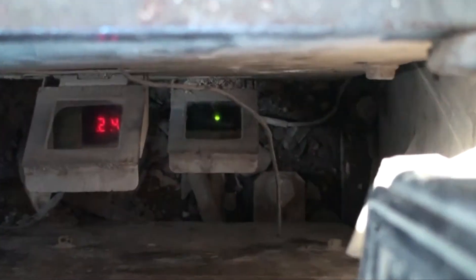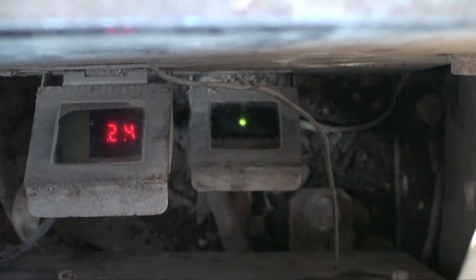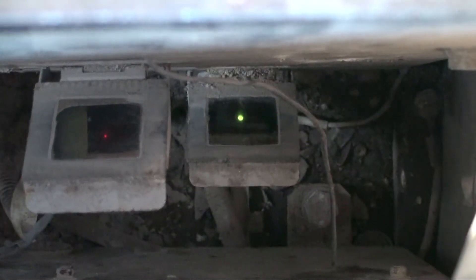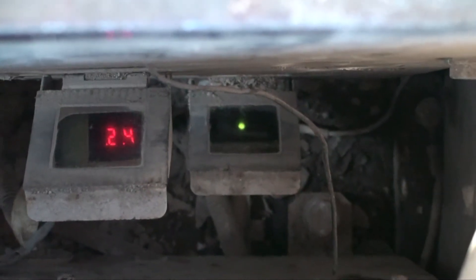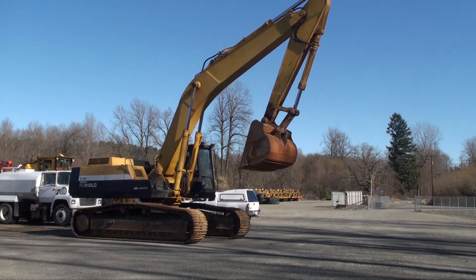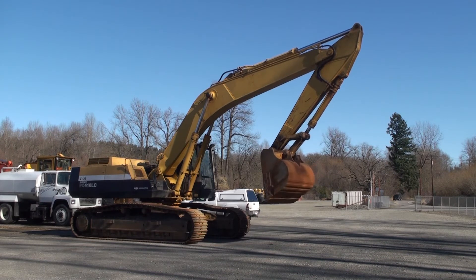The machine does have diagnostics in the package. The 2-4 in there is a code indicating that a pump pressure sensor isn't working properly or isn't connected properly. The flashing dot in the display indicates that the speed sensor is working properly — as the engine goes faster, that dot will flash faster. In these models, there are 30 possible combinations of fault codes you can see, ranging from nothing on the monitors all the way up to number 30. When the problem is fixed, the fault code will go away without having to be reset.